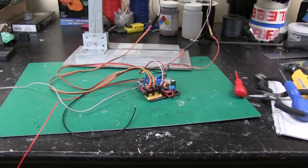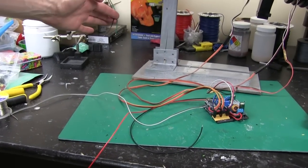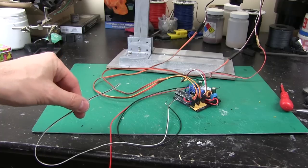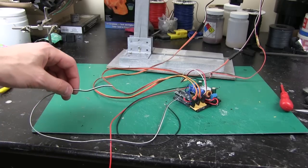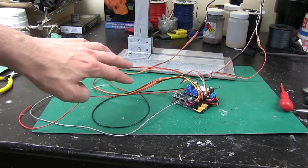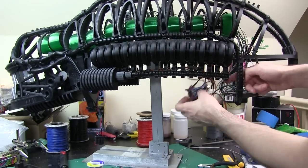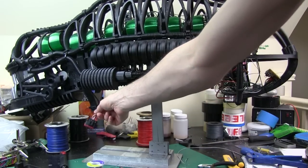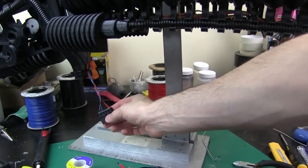Here's the head — we've got some electronics here. We've also got this other Arduino hanging around there which controls the head lighting, and that's got two wires for power sticking down. On here I've got two wires for power and I've got I2C which triggers the animatronics, which was wired directly to the hand and will now pass through the I2C bus on a connector to the arm and the body. So I need to put the same connector I did on the arm on here, then we can put a hub in the body with the battery. All the electronics are now almost inside the head and I've now got one neat connector, the same as the arm, which has power and I2C on it.